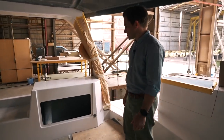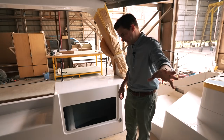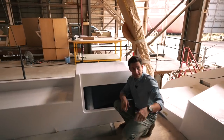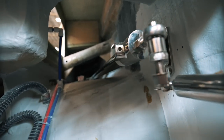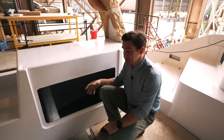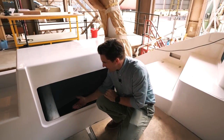Let's talk about the cockpit and helm. In the original design we had the LPG tanks down here but we decided to move those forward for a few reasons - mainly access. One thing we didn't explain previously was the steering system: the helm has steering cables that come through to here, then go through a sheave where they go across on a carbon crossbar - a similar system we've been using for many years on our other boats. Very robust and simple, but you need to be able to access it for periodic maintenance checks.